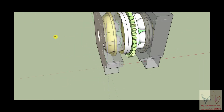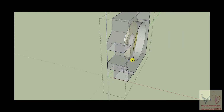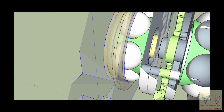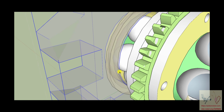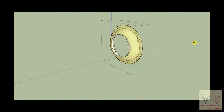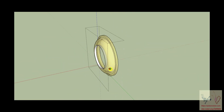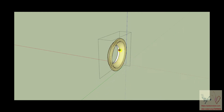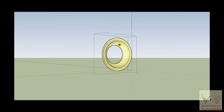And there's a possibility, I also think, that you could take this other metal part, this metal part here, I have a feeling that this too could be created by taking a donut shaped piece of alloy aluminum and putting it in a press and just warming it up so it's not at its melting point, not even near to it, but close to it, 75% of its melting temperature, and push on it, and you might be able to bring it up to this shape. And if your pressing die was fairly smoothly finished, you might be able to get this pretty smooth.